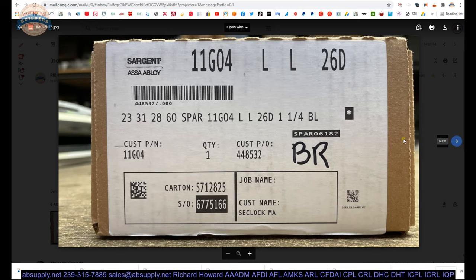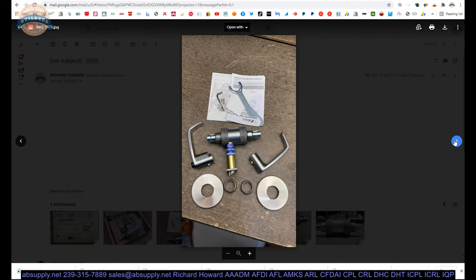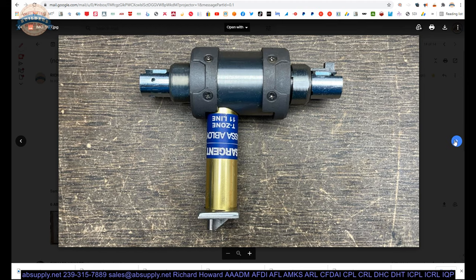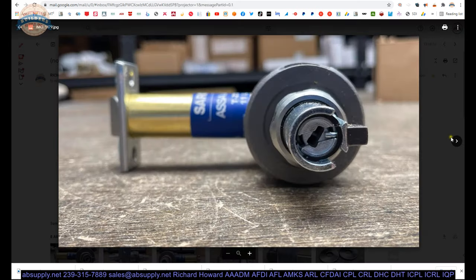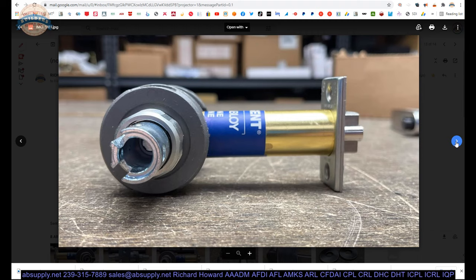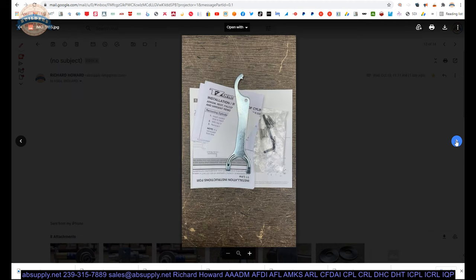Now some photographs — there's the box and its label; that's immediately what you see when you open the box. That's the contents — even though I don't have the strike plate shown there, it is included. There's your chassis, the business end, from different perspectives. Our lever catch button is here on the outside. Your latch bolt has the UL marking on it, meaning this is permissible for use on fire-rated doors.